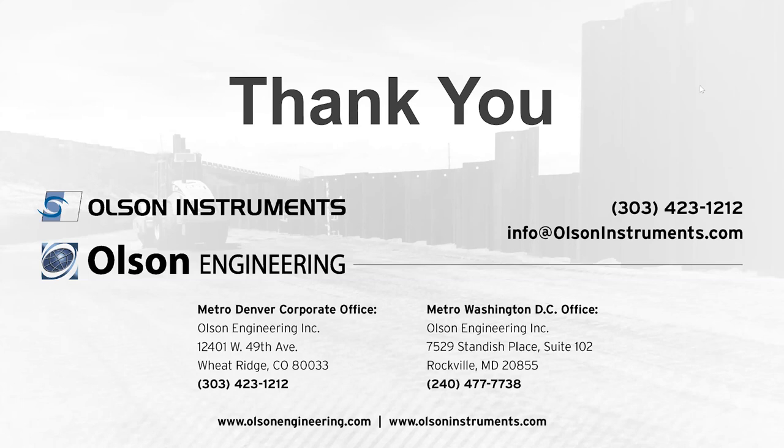What moisture source do you use? To measure moisture, the University of Maryland study looked at dielectric-type devices and the OHAUS moisture meter, which can do it in about half an hour in the field. Indiana DOT used that as well but ultimately decided on oven-dry moisture content. Doing a microwave in the field can have accuracy issues. There's a correction factor of about 11 percent applied to the OHAUS to agree with an oven.